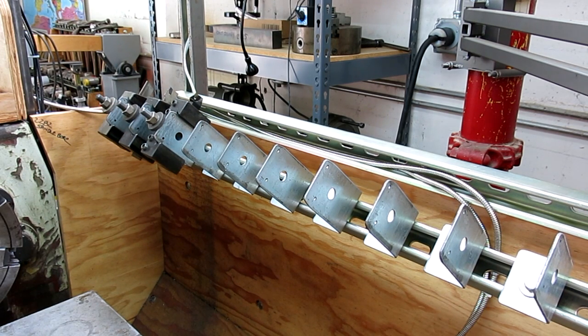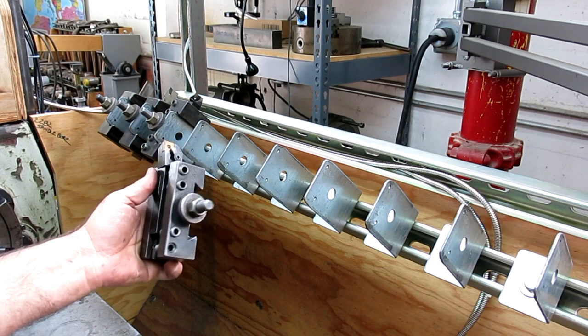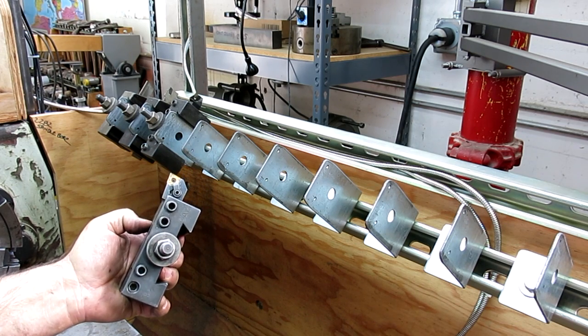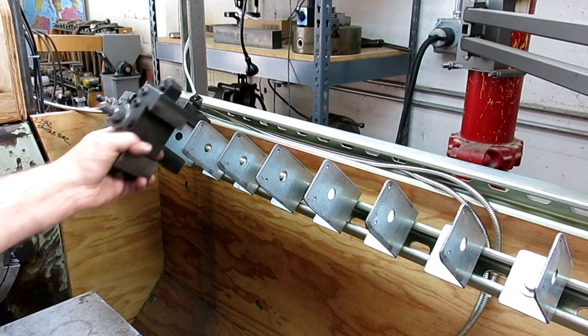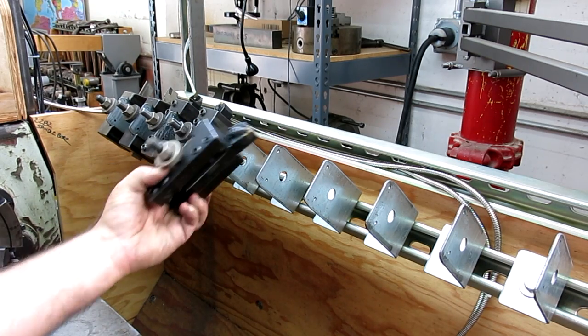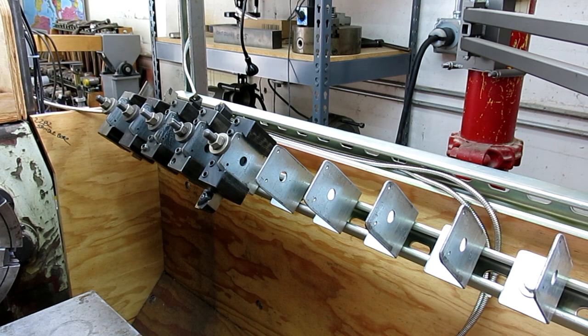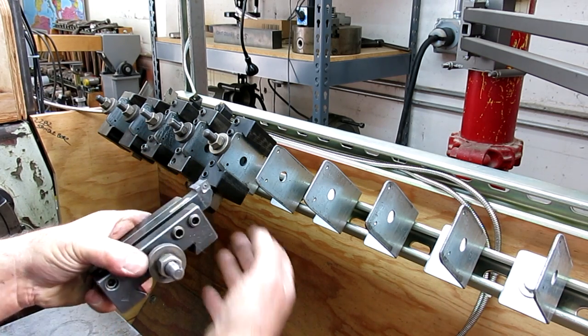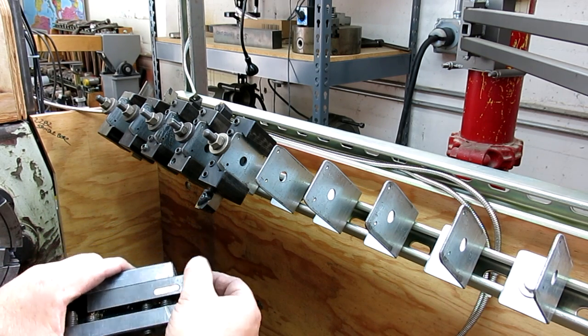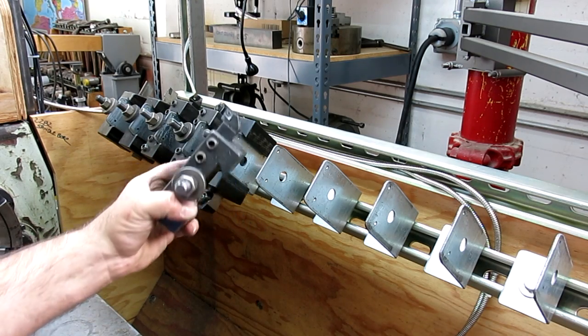Alright, moving on down the road here. This is your standard Adam favorite here, CNMG 432. It's a negative tool, 4 cutting edges, pretty economical inserts. Higher tool pressure than others. So here's the same thing, but a left-handed version. Okay, and I'm just going to put that on backwards like that, so they're all kind of going the same way, right? Okay, and then this is a CCGT. This is a positive insert, real sharp, light tool pressure. Lots of choices in that shape. Okay, so that's one of my faves.